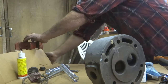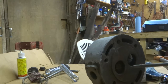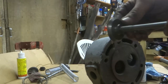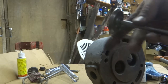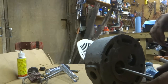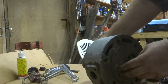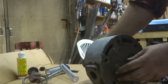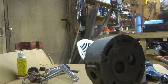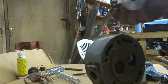And the intake valves, or intake valve, excuse me. This isn't more than one cylinder. This has been pressed together, but it hasn't been soldered together yet. I always silver solder my valves together. And I've reamed the head, put that in there. I'll still have to grind the valves, put them on the grinding machine, but that one's good. And then the exhaust valve hasn't been pressed together yet.